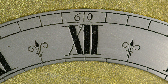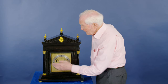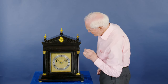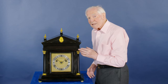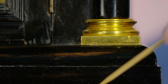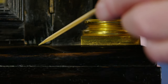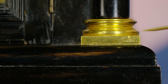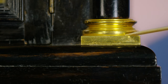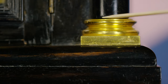In the centre is a beautifully engraved Tudor rose with so much detail in the flowering petals — one of Edward East's favourite motifs. There are lovely half-hour markers in between the hours, and the Roman numerals blend together beautifully. The columns have correct emphasis with bases — above the turntable base is the clock proper. In a Greek temple this level is called the stylobate, and mounted here are the four column bases, with small fillet radius, a concave profile scotia blended into the torus, both with semi-circular profile.